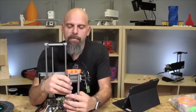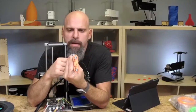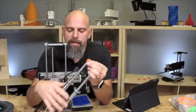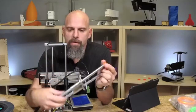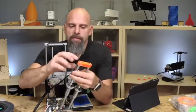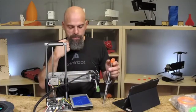It's kind of a lame example. I've got some better PLA that's printing out there now. But you see how these clamp onto the bars? Because you have to clamp these down so this won't twist. When this goes back and forth, you don't want it to twist at all, or your hot end's going to be swinging around. So I think I can eliminate these metal pieces a little bit on this bar, and I have that space to use because I've got an extra 2 inches.